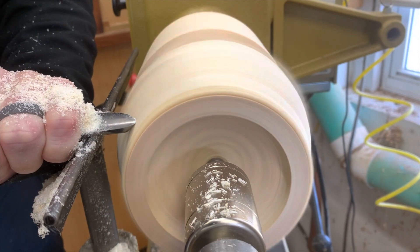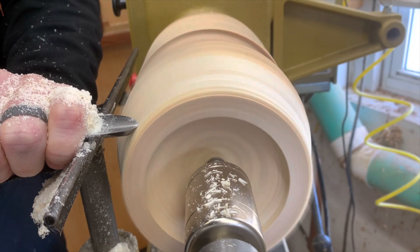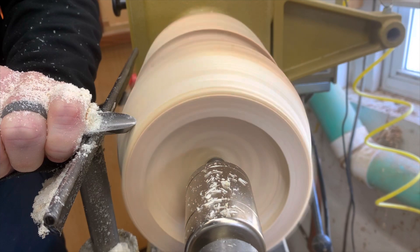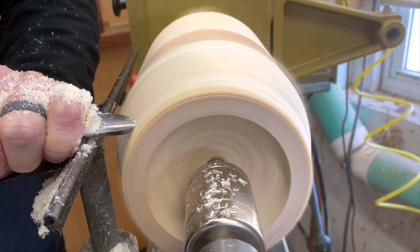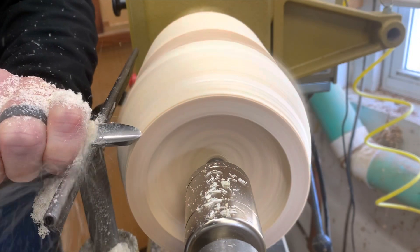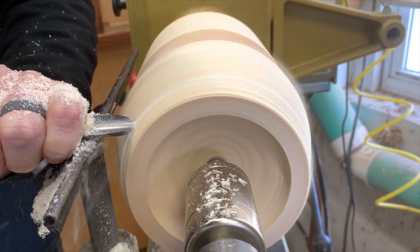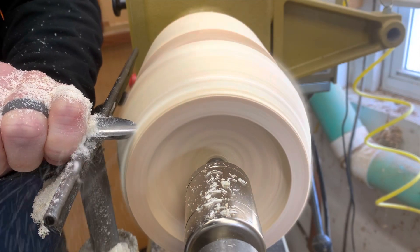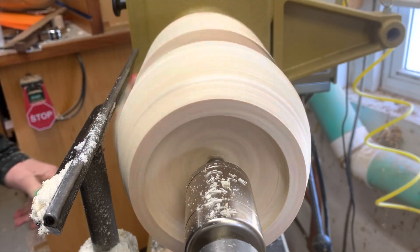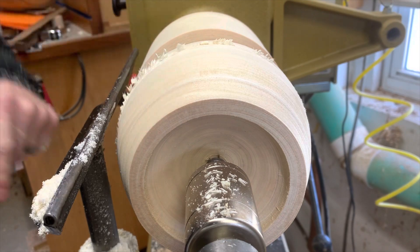Here I'm rubbing but not cutting. I can make the tool more aggressive with the tool handle. I need to pick the tool handle towards the cutting edge just to start the cut — you can control all that with your tool handle. If I want a deeper cut, I pick it up more; for a shallower cut, pull the tool handle towards you. Now look — it was rough before and now it's very smooth.